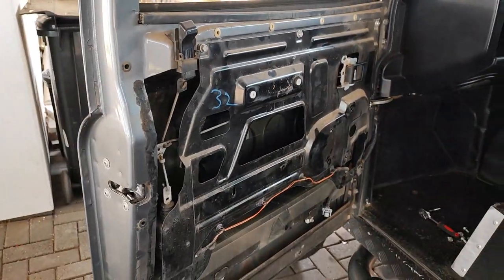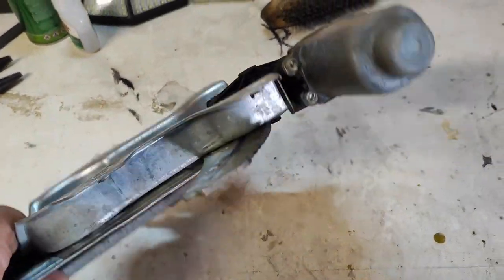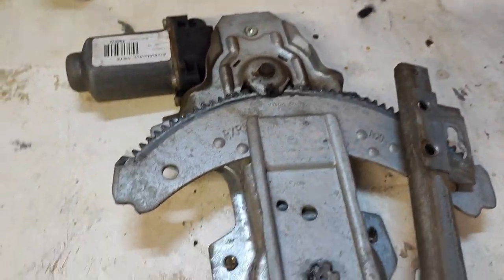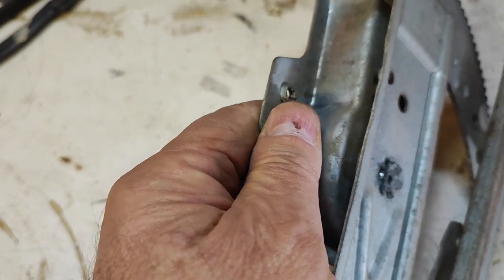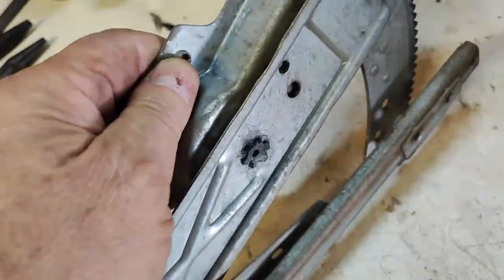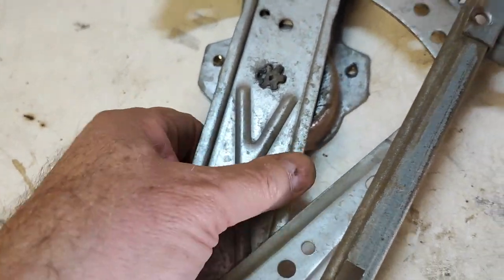I'm going to show you now what is wrong with the actual mechanism. Here's the mechanism on the workbench. I thought initially that maybe one of the teeth would be worn — you can see all those teeth all seem fine. But the problem is here: this little pin that clamps the mechanism the whole lot together — you see that thing there is worn. Let's see if we can get it to move doing one hand because I'm trying to film. See that there — so that's the problem.